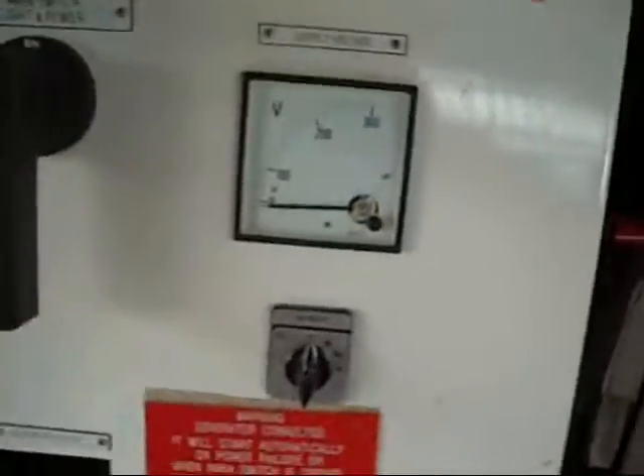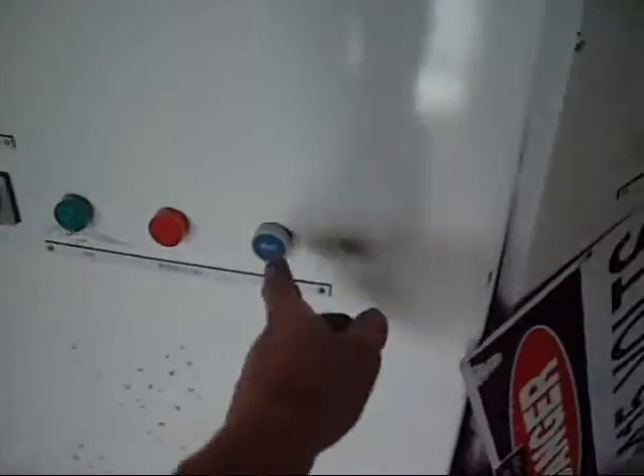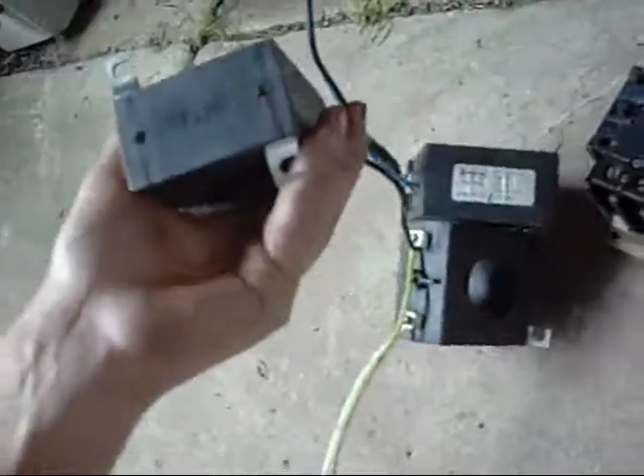There you have it, that's 50 bucks worth of switchgear - pretty damn good. I love these old-fashioned meters. I've got volts and 3 amp meters. That one goes up to 200 amps, the other two are 100 amps, for the main pump motors. I've got the volt, test switch, big reset switches. One of these big contactors, current readers - Crompton KN200 contactors. They have 240 volt coils in them too, very handy.